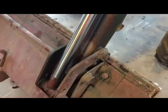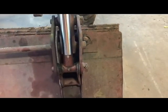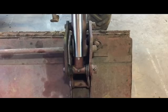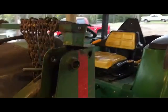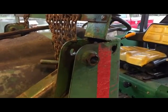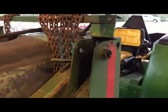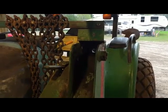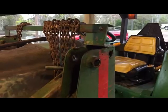I have a machine shop making new collars that are an inch and a half long — half of them with set or roll pin drilled holes so that I can pin them — and I'm going to weld them on all four existing collars onto the end. They're an inch and a half long, so I have them making pins that are three inches longer than the existing pins. The collars will stick out another inch and a half in length, which won't hurt a thing. As a matter of fact, it will make it stronger, and I will show you the video as I attach the collars.